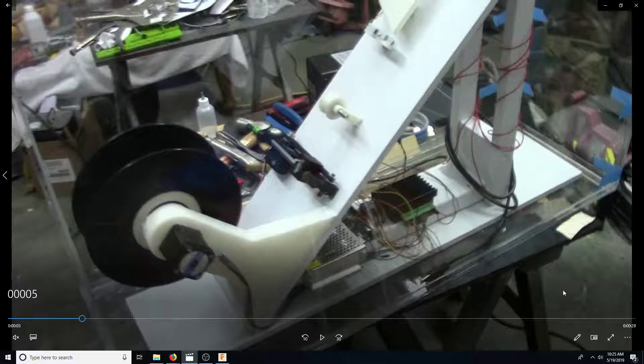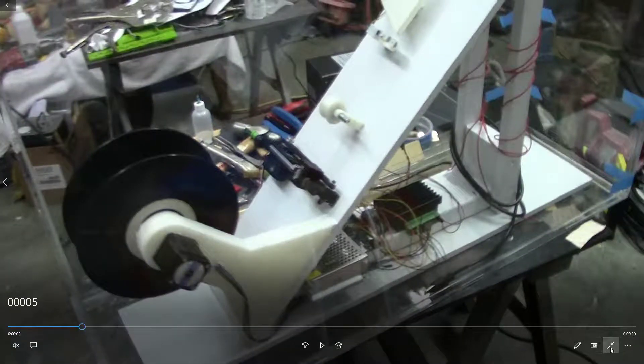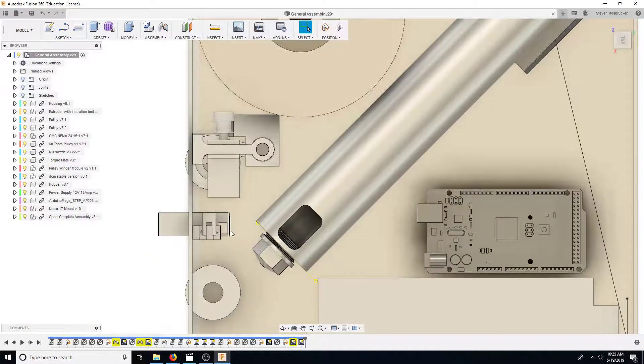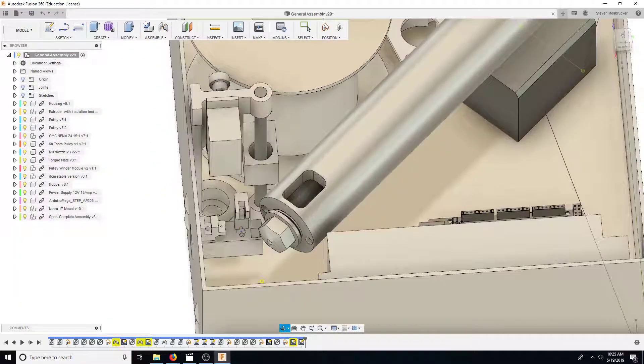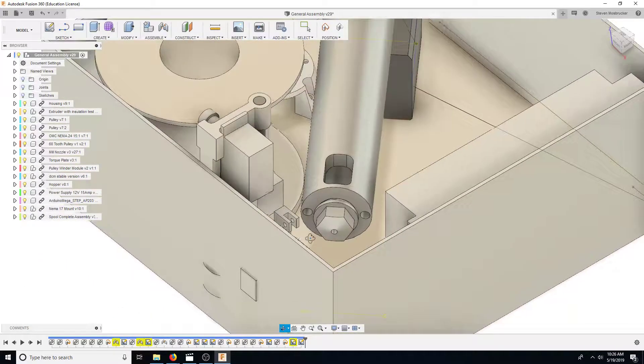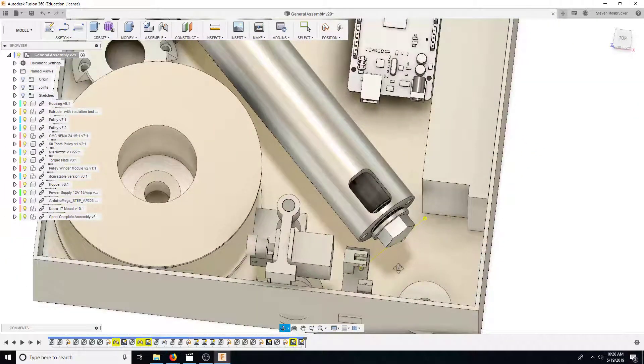The dimensional control is just the regular Multi-Shooter dimensional control — probably nothing else would be changed here; it just has a stand to make it taller for the test stand. Obviously it would be different inside the box. This uses a linear motion potentiometer on the inside to check the distance this guy travels in order to measure the diameter of the filament. It's a contact style, so we have to make sure it's solidified by the time the filament comes down through here.